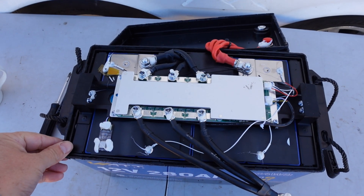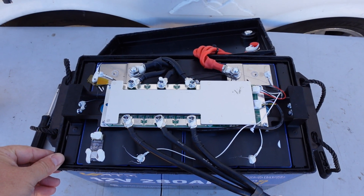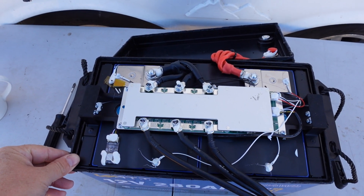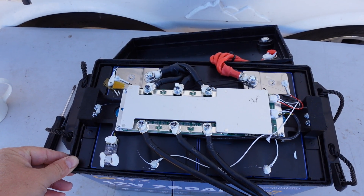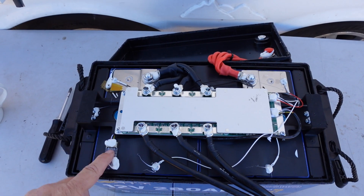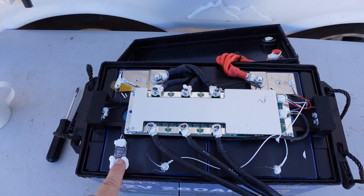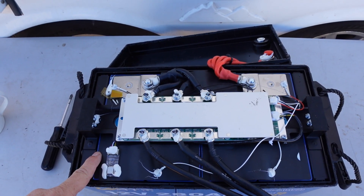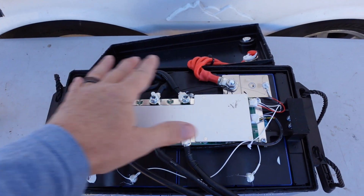Pulling the BMS up, you can see there are four big lithium cells with laser-welded, looks like aluminum, bus bars. Managed to get a picture of a QR code to look up the cells. The bus bars have a little hump in them for heat expansion. The BMS has a nice metal plate on the back. I give them kudos for listening to feedback and working to correct the problems in the original battery.